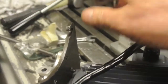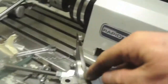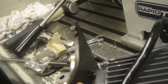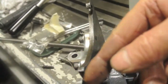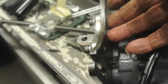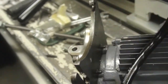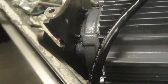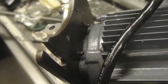One thing to note if this is successful and people decide to copy it: make sure that the securing bolts for the actuating rod bracket don't go through the back here, because they foul and stop the plate from moving when you adjust the belt tension. I tried to fit it, couldn't figure out what was going on, then took a close look and saw that the bolts were fouling. I had to cut a quarter inch off them because I didn't have any shorter ones. When I do have to take it off I'll remember: short ones go to the front.